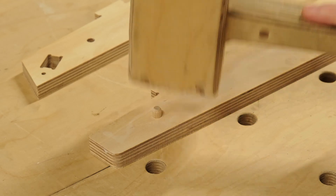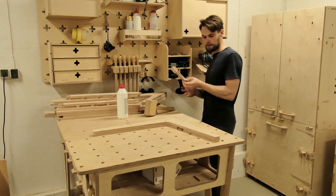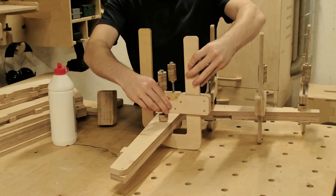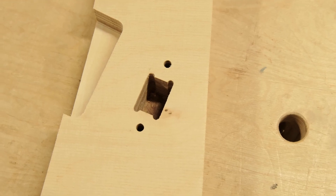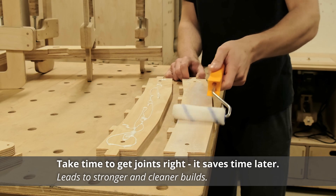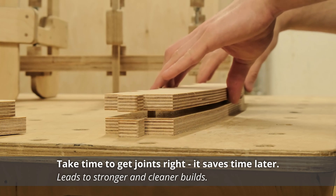And if the design is done right and the parts are crafted precisely, the further steps will be easier. While designing, we added positioning holes that help us align the components that have to be glued together. This simplifies the process and results in flawless alignment between the parts, especially since all the parts we are gluing together have joints. If they get misaligned, it will complicate the assembly and require extra work.